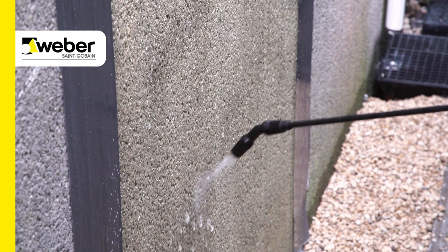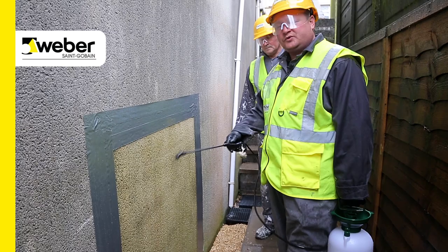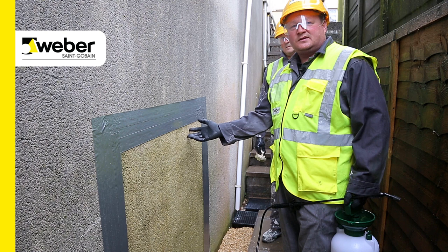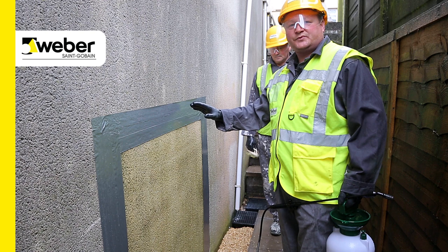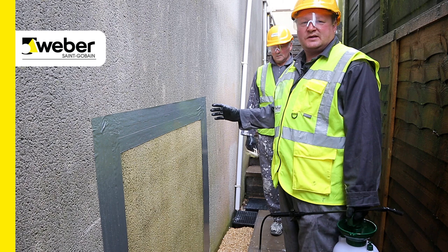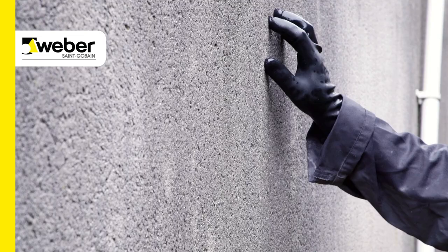As you can clearly see, quite a vast amount of that has already come off. This would now be left for 48 hours to do its work, then you would jet wash it with the fan setting. If it is as severe as this and been left over too long a period, it may take more than one pass. Once you've done the first one, which is the worst one, give it another good saturating coating, another 48 hours, and another jet wash. If it does leave a permanent stain, then you could paint the elevation with Weber SLP to create a uniform finish. But even if it is going to be painted, you have got to treat the algae first.